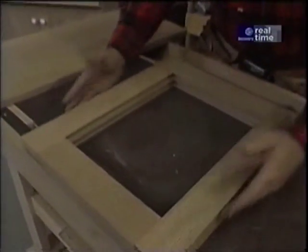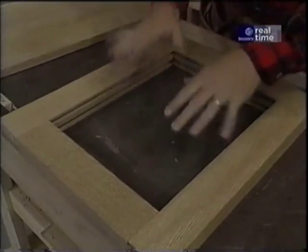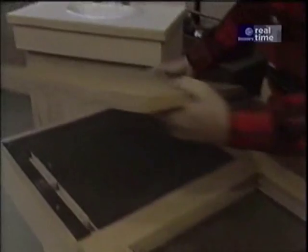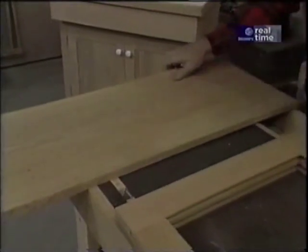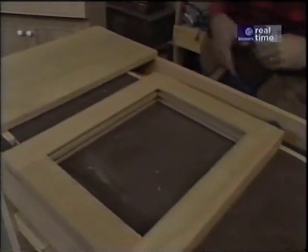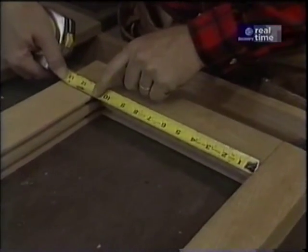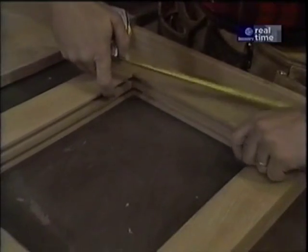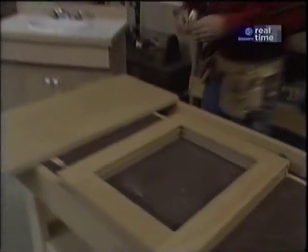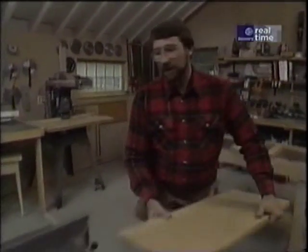Here's my door frames loosely fitted together. The next thing I want to do is make the panels. I'll use this piece right here, which is two oak boards that have been glued up, and I've smoothed out the surface. I want to take a measurement so that I can rip it to the right width. The opening here is ten and seven-eighths, but I want to make the blank three-quarters of an inch bigger so that it'll fit in these grooves — so I'm looking for a piece about eleven and five-eighths inches. I'll rip that right here on the table saw.